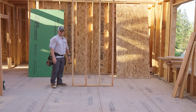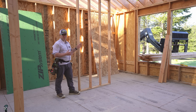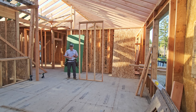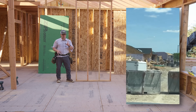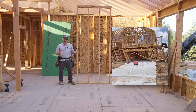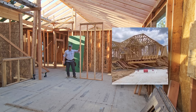This is a four-foot wall, 104 and 5/8 studs, so it's 9'1 and 1/8, double top plates. I've just temporarily screwed this thing together, so it's not a permanent wall. We want this wall to stay as a rectangle in high winds and in earthquakes. We don't want the loads on a building to end up any way other than through beams and shear walls or through collapse. We want to prevent collapse. This is racking — we have a wall that's fastened to the ground.